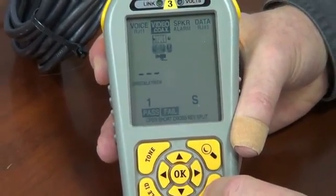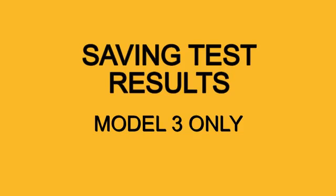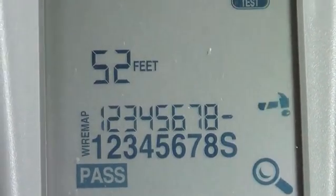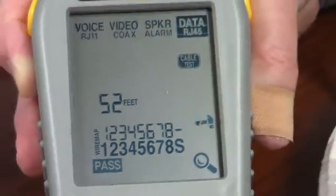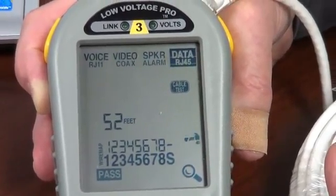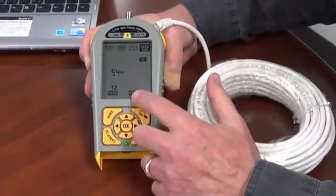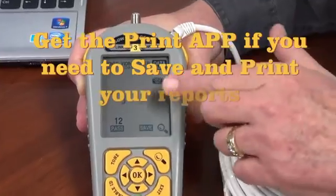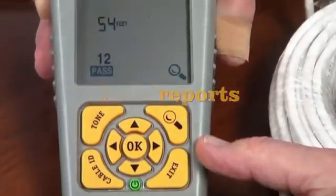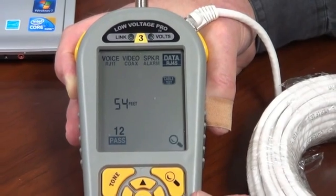Exit to quit. This is an extremely powerful test. When's the last cable tester you've seen that does propagation delay, skew, and ohms? At this point, what I would normally do is press the details button and say save, and it tells you that it just saved the ninth test into the flash memory. Printing is covered in another video, so we aren't going to worry about it at this time.